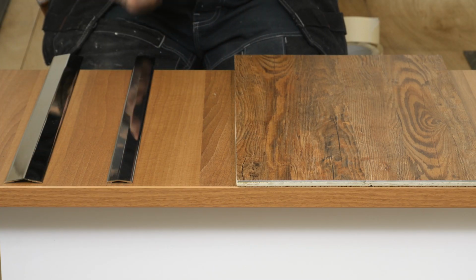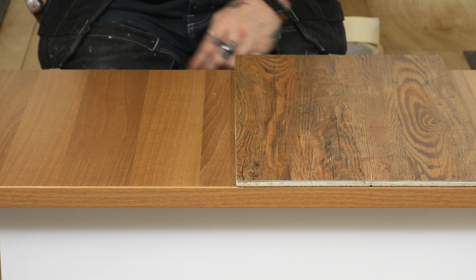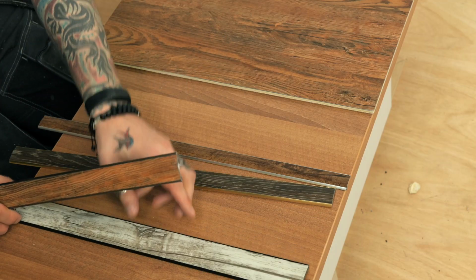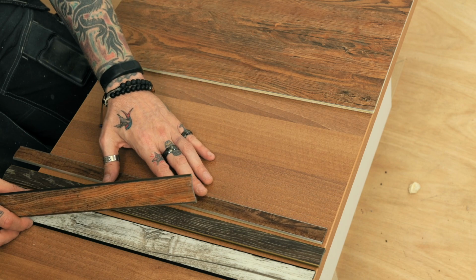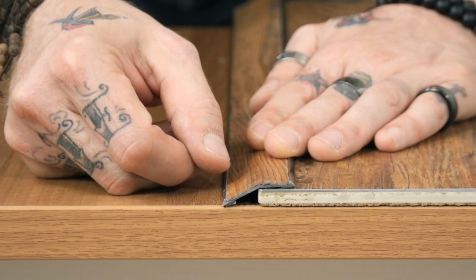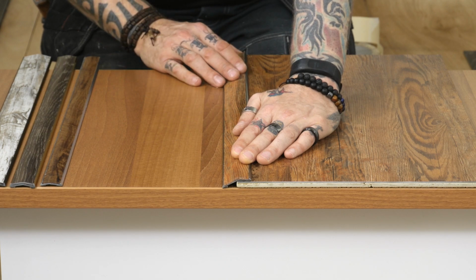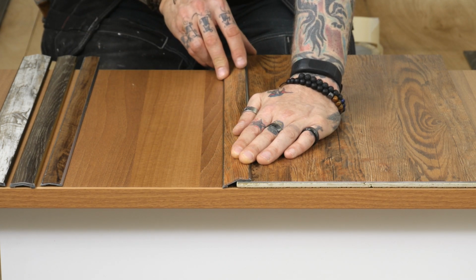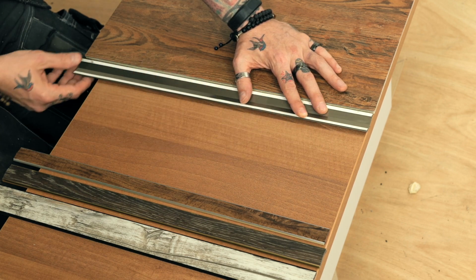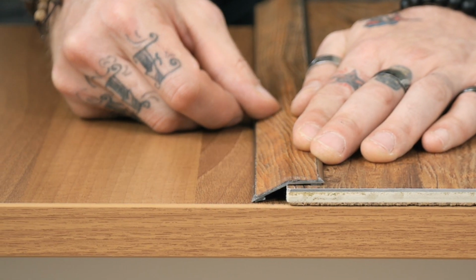So the same profiles are available in the aluminium range, but the aluminium range allows you to install the floor into the trim itself. So the brass gives it a very luxurious high-end finish, but if you want to disguise the floor or disguise the bar itself, you can go with the aluminium one and install the floor with a perfect match to the floor covering itself. Giving it a proper drop down just there. Both sets of bars come with pre-attached tape on the rear, and the aluminium range comes with the pre-attached high grab double-sided tape through the inlay.